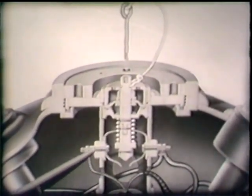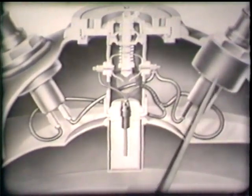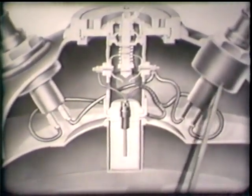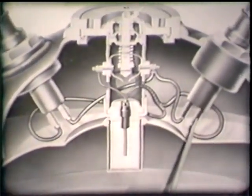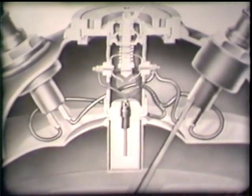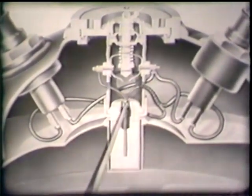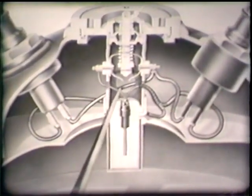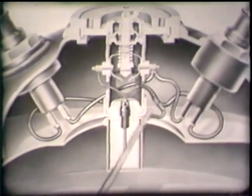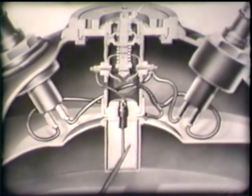The electric contacts in turn are connected to the electrical wiring system. When the plunger is down, the circuit is closed and the mine is armed. At the base of each horn is a small battery. It doesn't put out current at this time because there's no acid in the battery. The acid is in a glass tube up in the lead horn. When the horn is crushed, the acid flows down into the battery and the current is generated. These wires conduct the electric current from the batteries through the switch to the electric detonator. Crushing of either horn will send the current through the detonator, setting off the booster and the main charge.